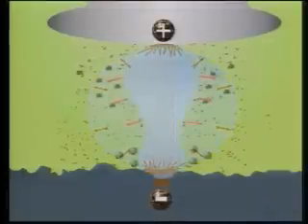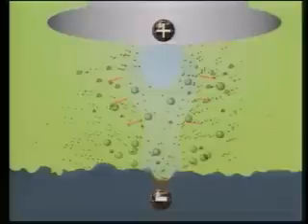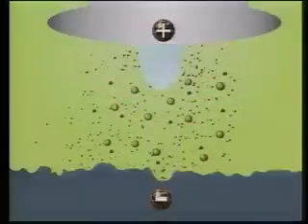Once the pulse ends, the spark and heating actions stop, collapsing the spark channel. Dielectric fluid then rushes into the gap, flushing molten material from both surfaces. This EDM residue consists of small solidified balls of material and gas bubbles.